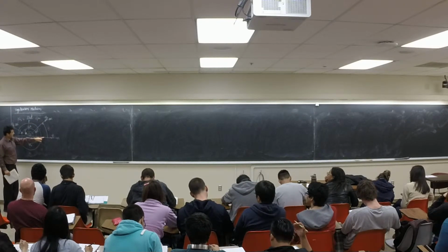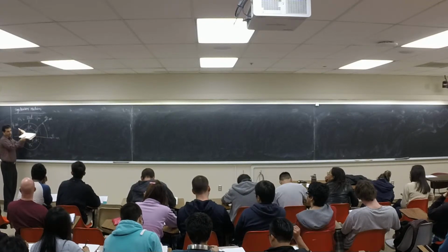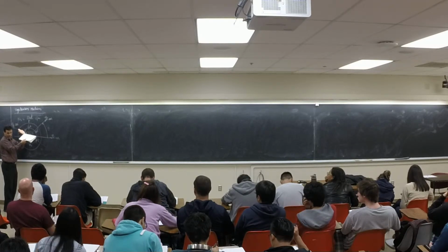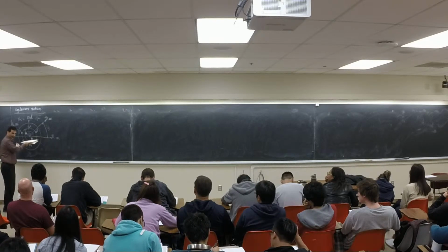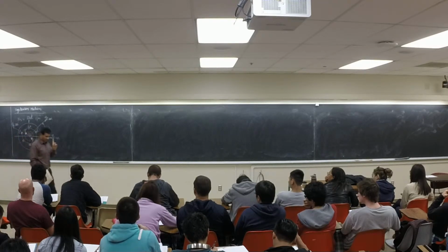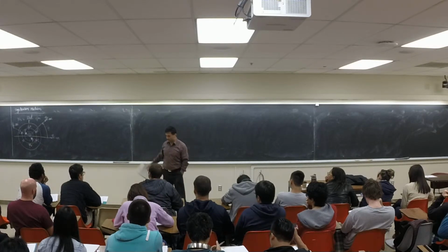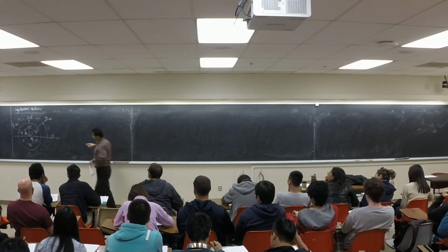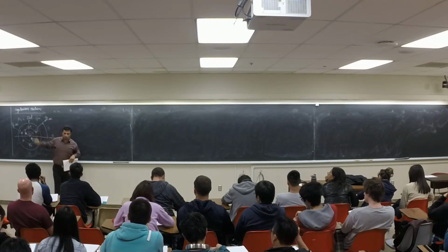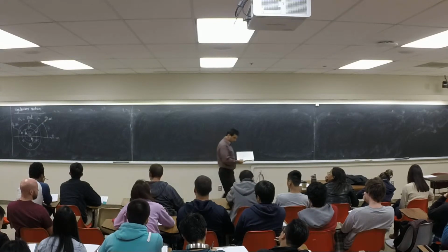But if you look between A and B, how much is the angle between these two? 120, right? They are not moving. They are stationary. Between A and C, 120. Between B and C, 120. I'm going to use these numbers, keep in mind. I'm measuring this one 120 and that one is changing. So I have 3 windings here, and I have one here. This one is rotating. Now I want to talk about the inductances of this machine.